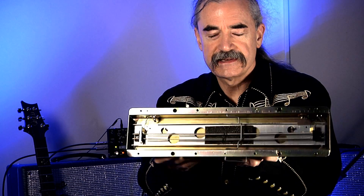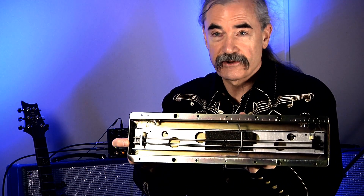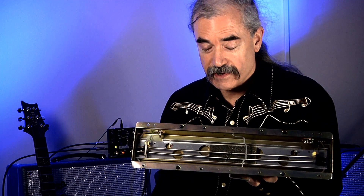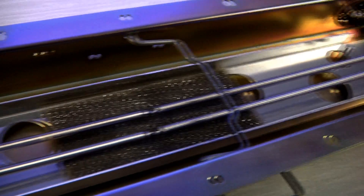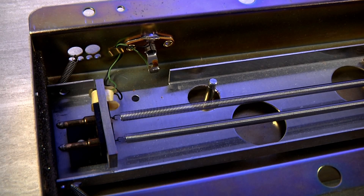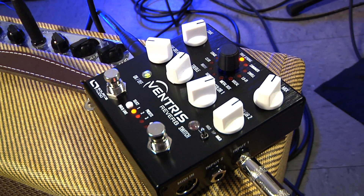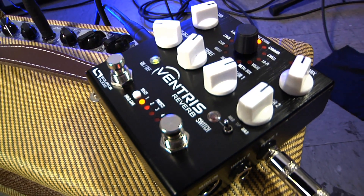The two springs are very slightly different — one has a delay of about 30 milliseconds, the other about 41. These two springs are represented by four delays inside the spring reverb algorithm. Following each of the delays is a high-frequency dispersion modeler, which delays the high frequencies more than the low frequencies. It's done with all-pass filters — a lot of them.